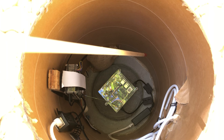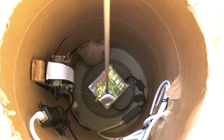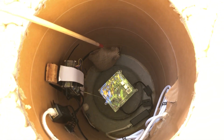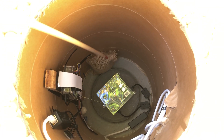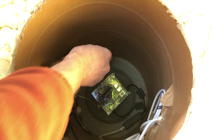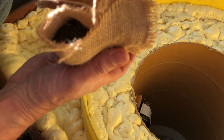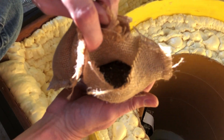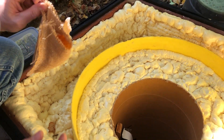One thing I wanted to monitor was whether any water was getting in, given my first failure — that's why I added the second Pi. Down below there's a temperature chip, and I'll have links to all the components. The main reason I come in here is to make sure everything looks good, nothing has moved, and to change out the desiccant pack that keeps humidity in check. I usually change it when it hits about 50 to 60 percent. The pack is reusable — it starts out a nice orange color and turns green when used. You put it in the oven for two to four hours and it reverts back to orange.